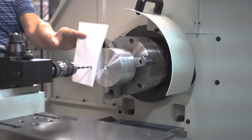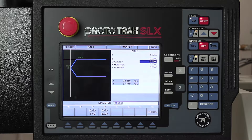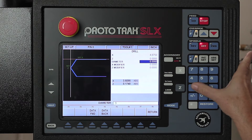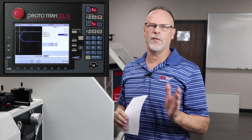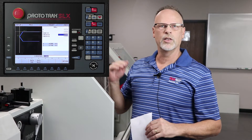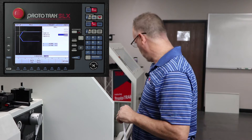And call that zero. If I wanted to be really picky, I could put the two thousandths in, but it's really not that important — I have the ability to adjust later anyway. The last thing it wants to know is the actual diameter of my drill bit, and it's 0.3125. So what the control is going to do is take half the diameter of the material, half the diameter of the drill bit, and put it on center.